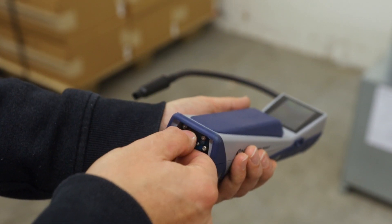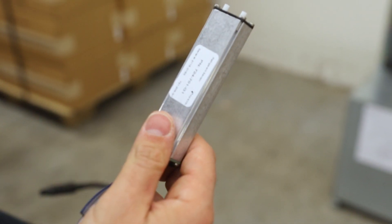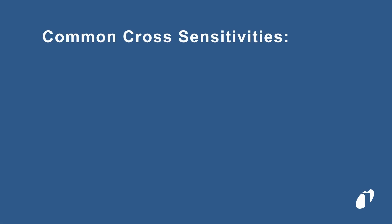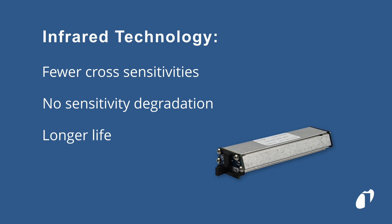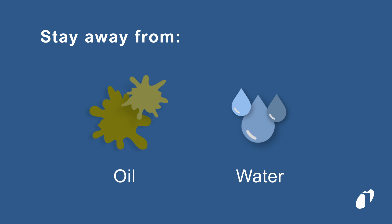For example, DTEK3 and DTEK Stratus have infrared sensors that tend to last much longer than other sensor types. Depending on your leak detector sensor technology, be aware that certain substances like oils, soaps, sealants, solvents, and even pipe insulation can cause false alarms. Infrared sensors have fewer cross sensitivities and won't alarm to common causes of false alarms, but they'll still react with alcohols. Be careful not to contaminate the detector with oil or water, as these can damage the internal components.